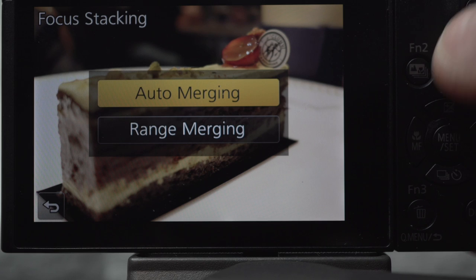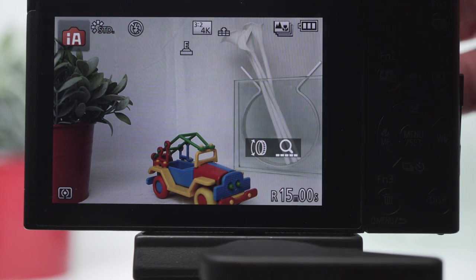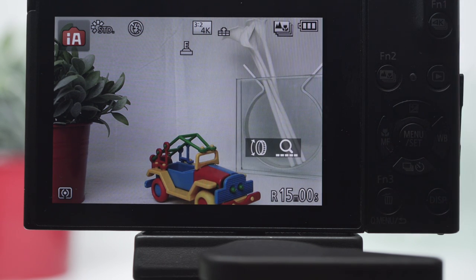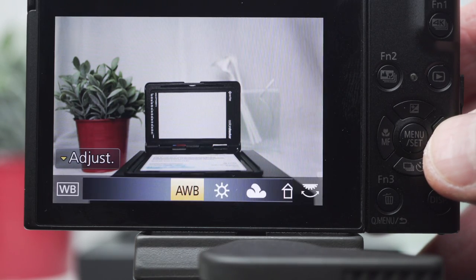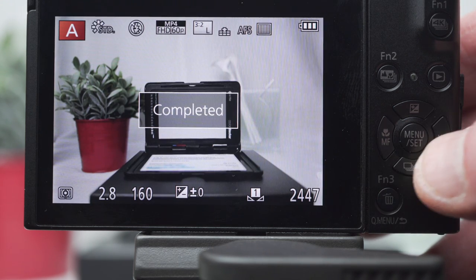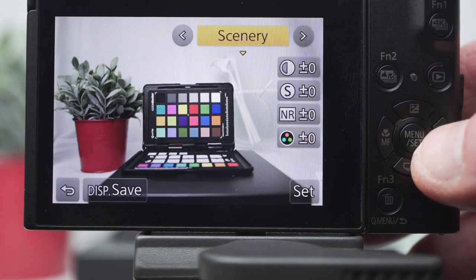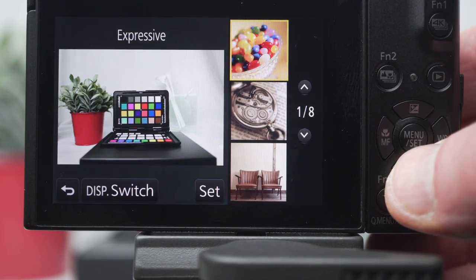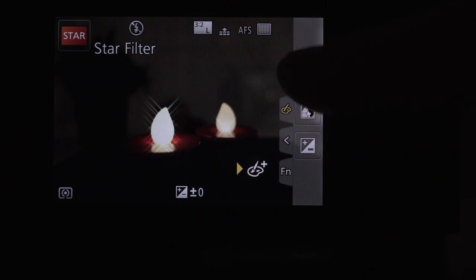Now you don't have to worry about which end of the eclair should be in focus. Intelligent Auto mode works well but can save only JPEG images — switch to P for RAW or RAW+. Auto also engages the digital zoom up to two times, giving 36 to 216mm instead of 108. There's a dedicated white balance button to the right of the control dial with presets and four custom settings as well as degrees Kelvin. The photo style menu provides an interactive screen to select from several presets and fine-tune contrast, sharpness, and saturation. Creative control mode also provides color effects along with other effect modes like toy, monochrome, miniature, and star effect, many of which have additional options to fine-tune.